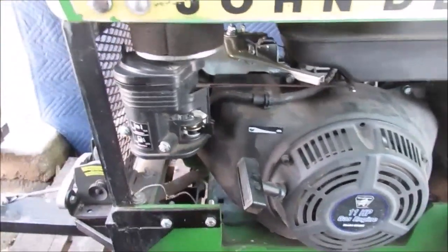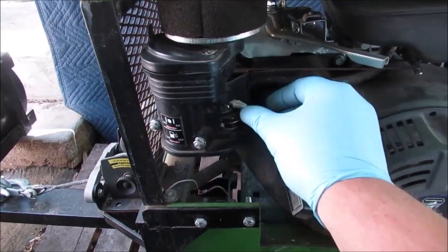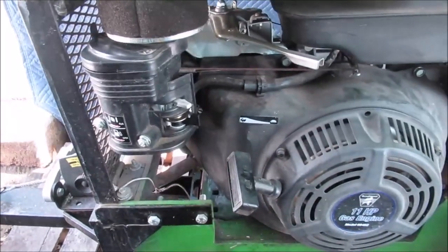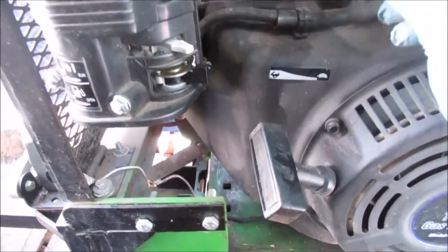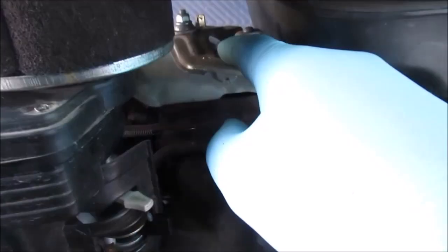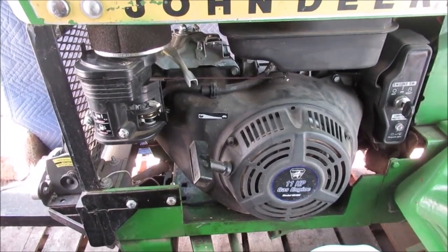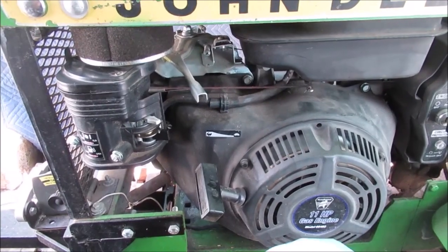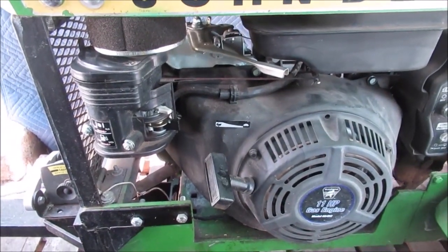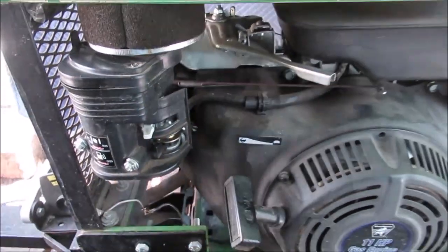Got a lot faster idle. I'll try to set my idle down back there just a bit. I think I did the wrong thing — that's your fast speed, that's where I had that little cap off. I had screwed it a little too far. Shut your gas off each time, put the choke on.